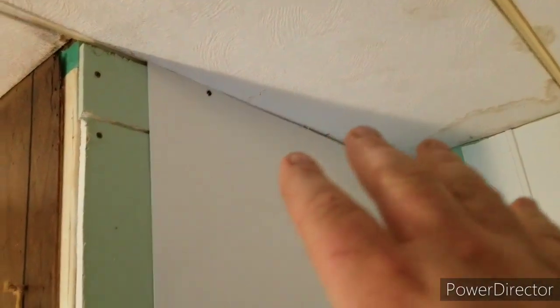I've got parts of the shower surround up. The instructions say to take painter's tape and tape your panels to your wall to hold them, then do your measurements and make sure everything's sitting right and you got your holes drilled. Well it's so humid the tape wouldn't stick, so I had to get it as close to the ceiling as I could and use some drywall screws just to hold it and do a dry fit to make sure all the panels are right.